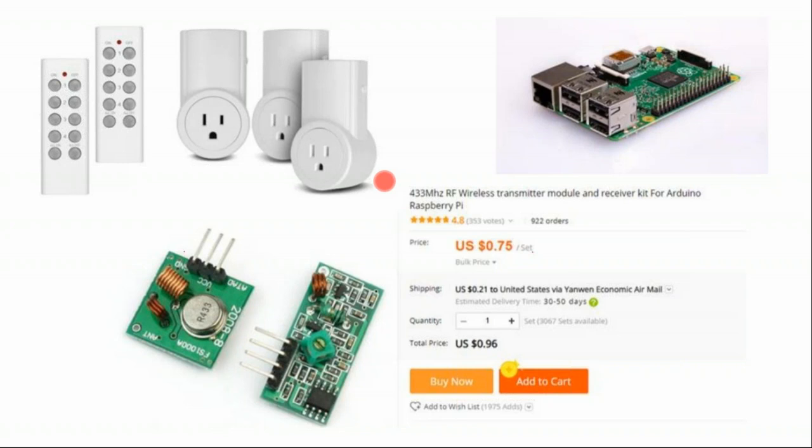And then eventually there was another iteration of the technology which boosted up to 900 megahertz, and then you could use your cordless phone all the way on the other side of the house. And that's where Zigbee and Z-Wave are today, in that 900 megahertz frequency. Whereas Wi-Fi has continued to increase the frequency and increase the energy required to transmit the data, but that's also made the signal quality better and more data rich.